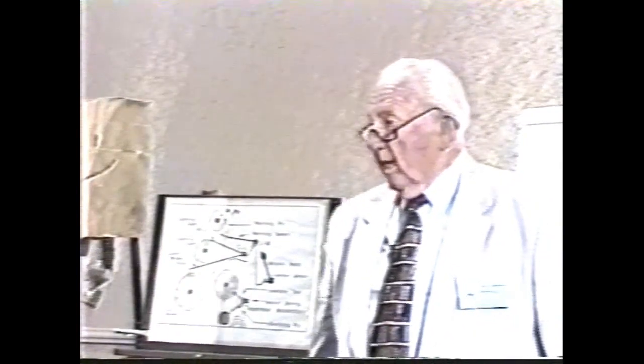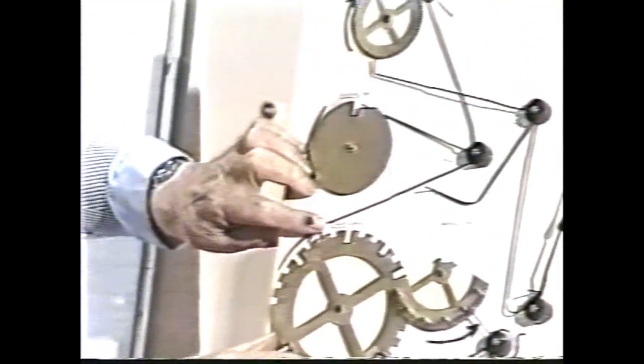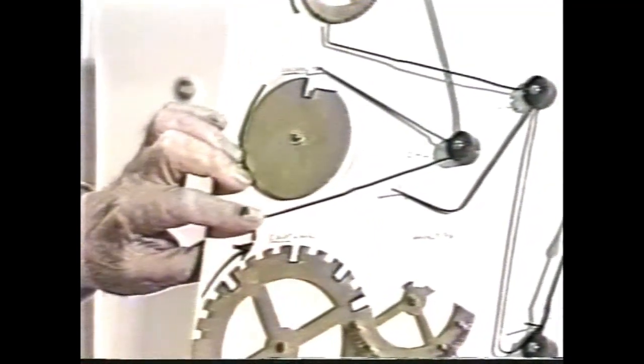And I don't have to tell you, one of the most irritating and annoying errors in count wheel striking is this count wheel hook getting caught in there. Knowing what parts do what jobs, you will understand that if this, in the course of running, does get stuck against the front and bend or looks like it's going to do damage, or perhaps it's done damage already, what you must do is adjust the distance between these two arms that have gotten a little bit distorted, so that when the count wheel hook is in a deep slot, locking safely takes place, okay? You know how to adjust for that.